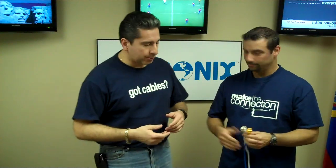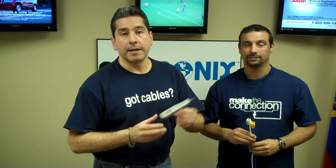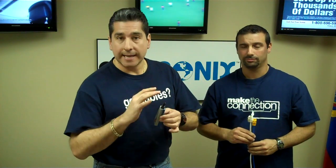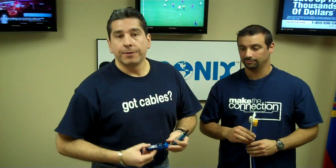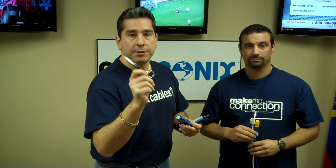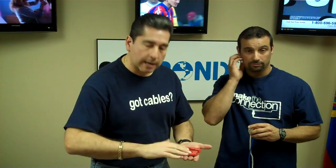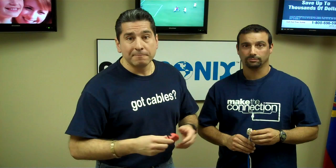Thank you, Ted, so much for stopping by and showing us how to punch down the proper way — Cat5e and Cat6 keystone jacks with Cat5e and Cat6 cable. A couple simple tools: keep in mind the punch down tool with the 110 blade and the cut on the blade itself. For those with a preference, we do have what's called the Smart Strip by Ripley Tools to prepare the cable. Or, if you want, we have electrician scissors as well to strip and prepare the cable — that's a preference. Keep in mind, sometimes we have these little rubber bases to absorb the punch down so you're not doing it against the wall or on furniture. Sometimes we'll throw these in for nothing. So keep us in mind for your next application, whether it's voice, video, or data.